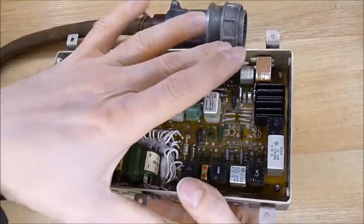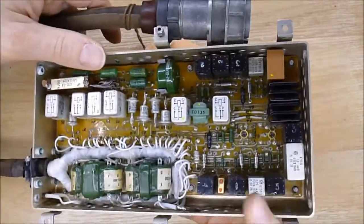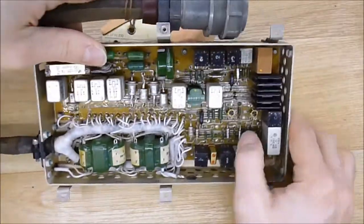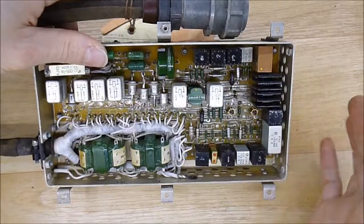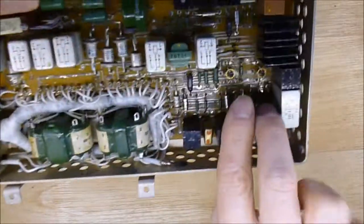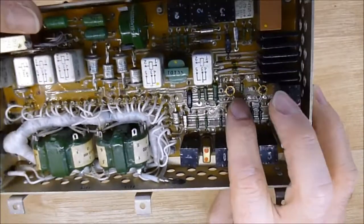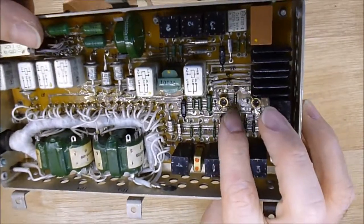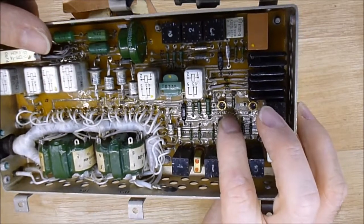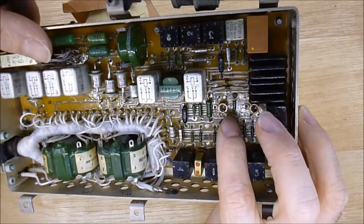I really must find more info to show you how it looks inside, because it's quite interesting. Apart from that, we have several relays, diodes, trimpots, and here we have some kind of five-leg capacitors, transistors in metal cans. Maybe they are operational amplifiers — five legs is just enough for an op-amp.